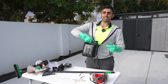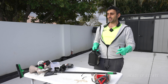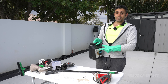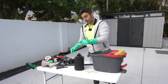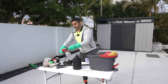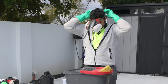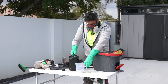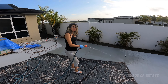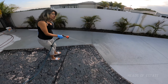There are two ways to use it. One is the heavy duty way where you use it as is. The general purpose way — which I'm going to use since I already pressure washed — is to mix one part of this with four parts water. Before you play with this, make sure you have proper gloves, proper protection, and even a mask because this can burn your lungs. Also make sure you wet the area before applying because it goes on a lot easier.